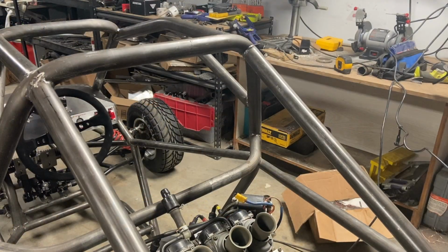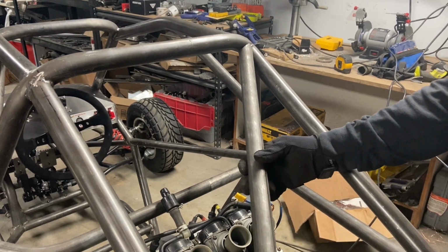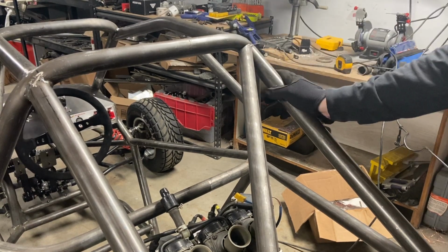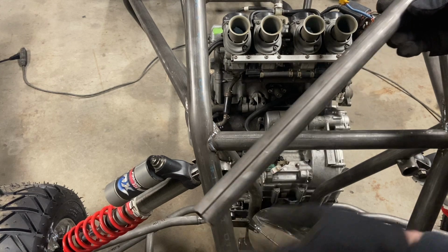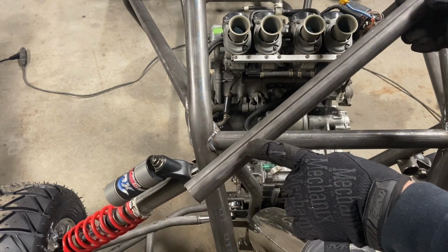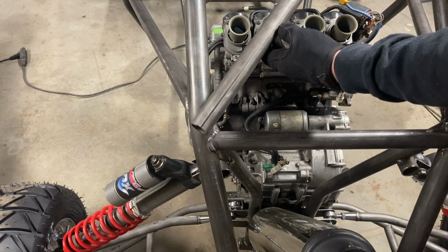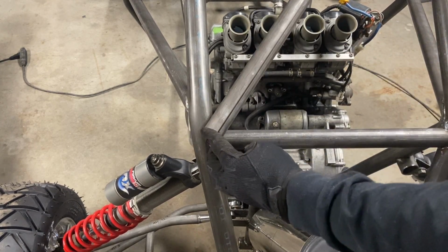All right, once you have that notch cut, you can test fit it. And as you can see, it slides right in there. There's plenty of weld area, and this is all triangulated. So now to make a tightly fitting cross member, you find your line you made, and that was facing up. Slide that into its tight position up top of your double fish mouth.